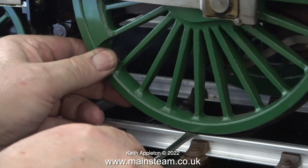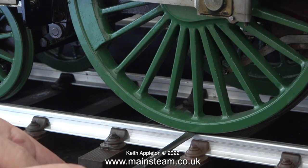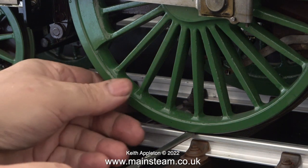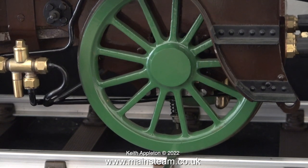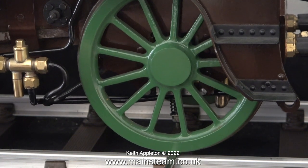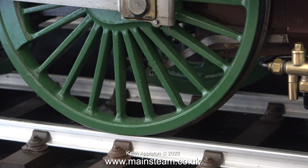On this Stirling Single, I'm rolling one of the large center wheels onto the screwdriver — this is really taking some effort; I'm having to put a lot more pressure on to lift the wheel, which means that most of the locomotive's weight is on the center wheel. The trailing wheel is slightly different — when I put the screwdriver under it, it tries to lift the entire locomotive. The axle boxes on this wheel may not be chamfered quite as much as on the others. The main thing is that when I lift any wheel, all the other wheels remain on the track, and most of the weight is on the center pair.